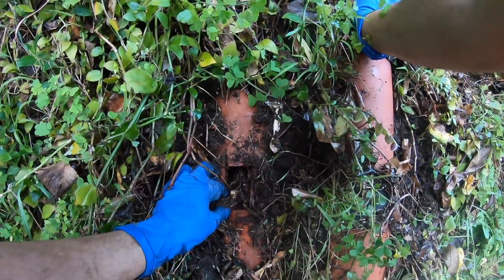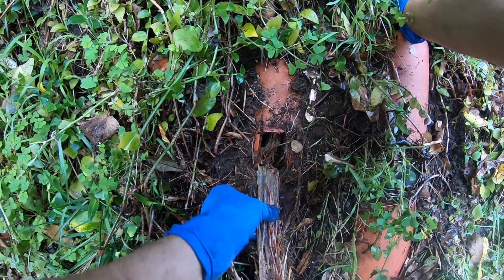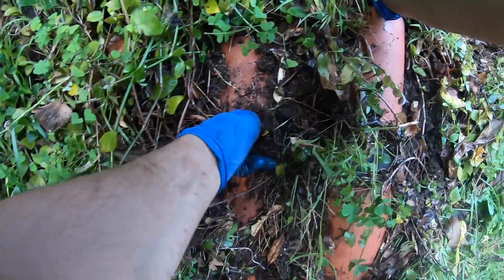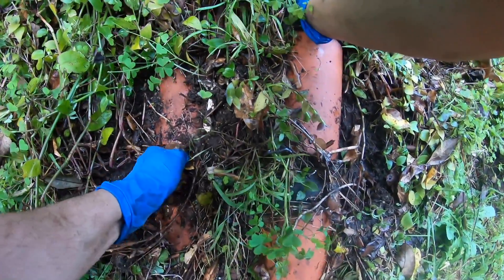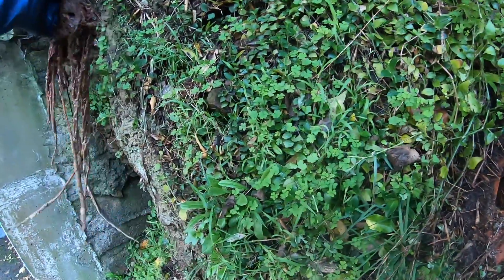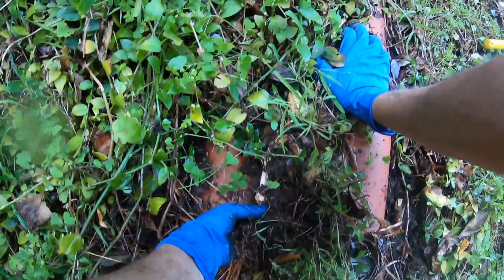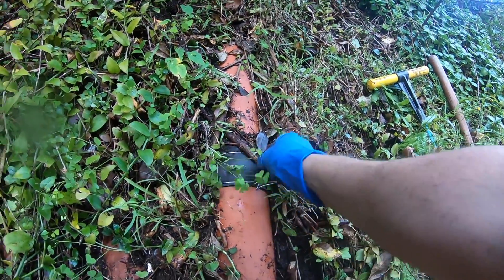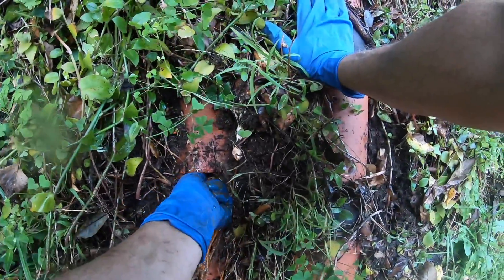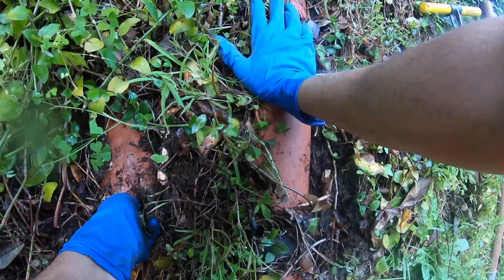Someone's already been here quite some time ago by the looks of it. Oh yeah, see that — looks like something out of Alien, didn't it! So wow, yes, it's so thick. There's some serious roots in here. I'm just grabbing — just pulling out. One of the joins up top there, one of these rubber-type rings with a steel wire tie. Oh, it smells rich too. I can feel my hand in there — this is probably growing a really solid plug down here. No wonder it couldn't get through.